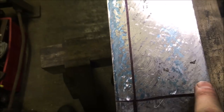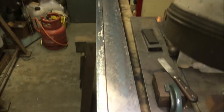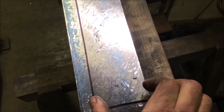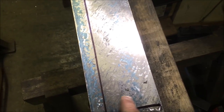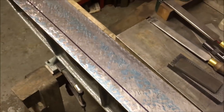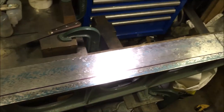So you can see by the print, we're bare there because we're not covering it with the straight edge. But then we've got a big section here, the full length, which is bare. However, we know that when the straight edge is printed in this section, we've got a perfect print, or certainly as good as it needs to be. So it's basically sitting between this point and coming to a rest there. If you look at the actual print, you can see it's harder on this side than the other. And that's all the way down. So we're just going to keep removing this section down this bank until all that blue travels across. And not take too much, because then we'll end up with it being high in the middle.